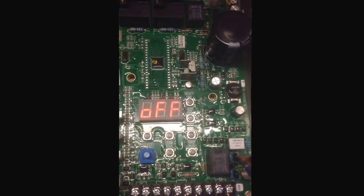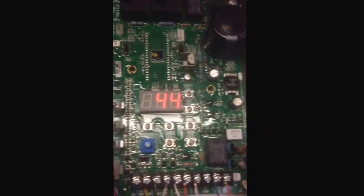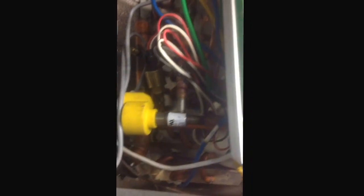Just for reference here, I will take it out of service. There is the service terminal and there is the C. Those two were jumped and put into service — you can see it's now coming out, it's in the off position, going to cycle back through into global refrigeration. So there's how we determine where the bad TXV — EXV valve is. We also had a bad one on this system last week, so we had two on this system. There's the EXV that we'll be replacing down there on the end. Hope this helped you out for you Beacon 2 guys. Talk to you later.